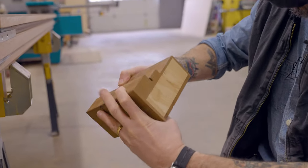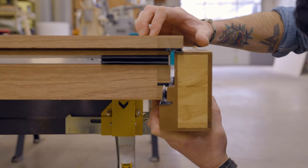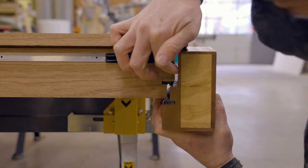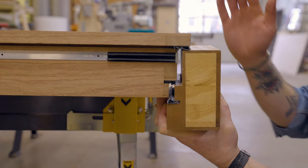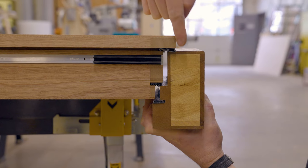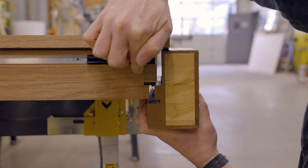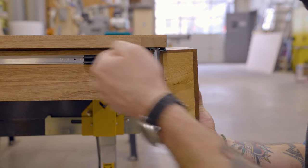Here is another 12-millimeter gasket that goes in place. When the frame goes on, we've got four millimeters of gasket compression here, five millimeters here, five millimeters here, and about a four to five millimeter air gap along here. The four-millimeter air gap accommodates the swing so there's no need for a beveled edge, as well as room for the strike plates on the frame. This gasket is continuous — mitered on the corners, it travels around the bottom side of the door, up two sides, and across the top. There'll also be an automatic German-made drop seal routed into this section, which makes contact with the threshold — so you have the sweep against the threshold, this gasket against the threshold, and the drop seal. That's three gaskets on all four edges.